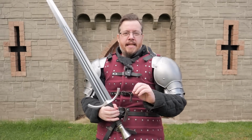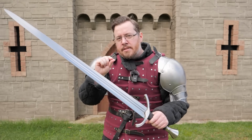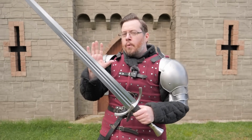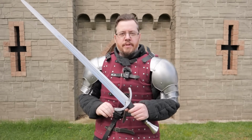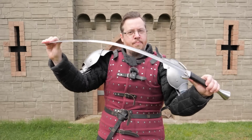The amazing thing is if you actually release some of that stress by reheating the metal a small amount, making the metal have a type of orange tinge, we're not red hot, glowing white or yellow, but usually just an orange heat on the blade, it will release those stresses in the martensite structure and that creates a spring.